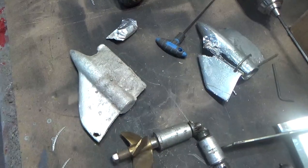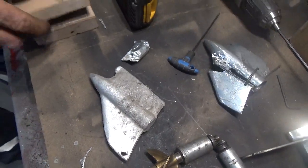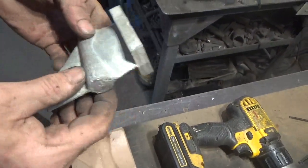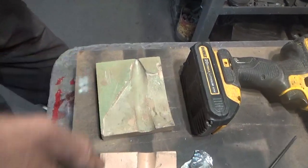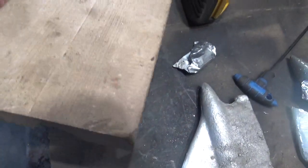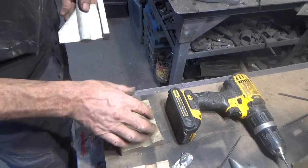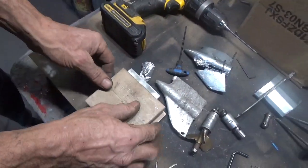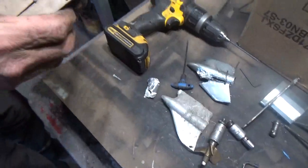How did I make it? I'll show you. So basically what I did is I sculpted one. And then I made these, believe it or not, molds of the one I sculpted. This is Bondo. Believe it or not, this is Bondo. These are the negatives. I made another positive, kind of like this one, out of strand glass, fiberglass, in my Bondo mold.